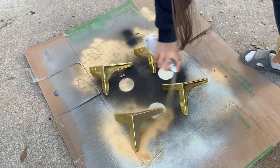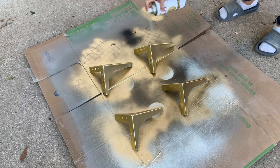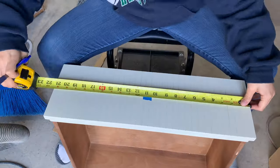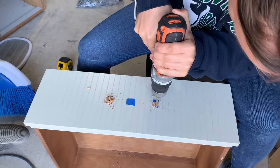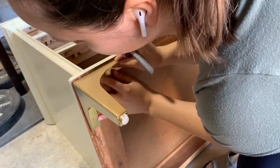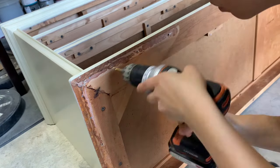The legs are from Amazon and they come really glossy yellowy gold, which is not what I'm looking for, so I like to spray them with Rust-Oleum's metallic gold before attaching them. Next I measured hardware holes — this little blue stencil comes in super handy for this, and I always tape before drilling because it helps prevent splintering. I added new hardware from Amazon, attached the new legs, using a Sharpie to mark where screws will go and then pre-drilling right on those Sharpie spots.